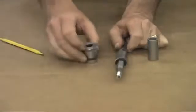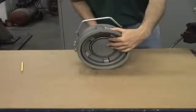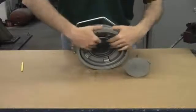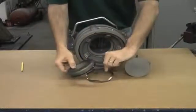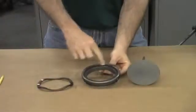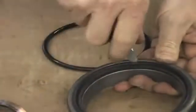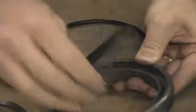After replacing the seals for the shaft and stuffing box, the next step is to remove the poppet as well as the nose seal, which contains your cylinder and cylinder o-ring. Slide the poppet out of the face. With the poppet removed, remove the cylinder. The cylinder has a nose seal and a cylinder o-ring, both of which we will replace. Remove the cylinder and the wave spring. From the seal kit you'll receive a new nose seal and a cylinder seal. Remove the cylinder o-ring first, then remove the nose seal using a small screwdriver — insert it into the groove to get it started, then simply pull the ring out.